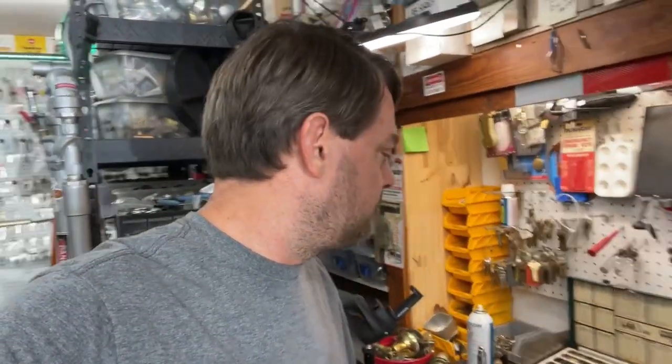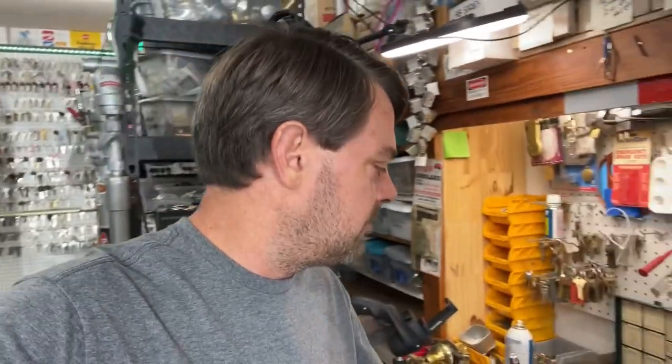This is like the 7 line or the 6500 line, grade 2 lever handle, very common on interior doors for the most part in buildings, and also very common for locksmiths to come along and switch them out when the lever starts sagging, because that's one of the biggest problems with them. They do not have a clutch mechanism in this particular style, so after a lot of use, they just get all wonky and you end up having to replace them.